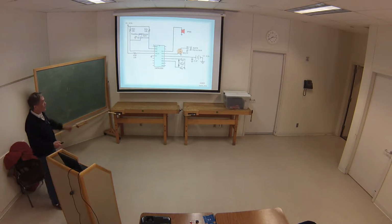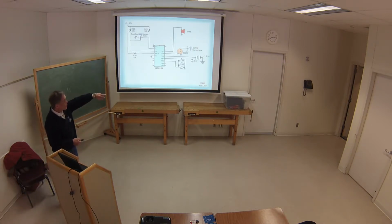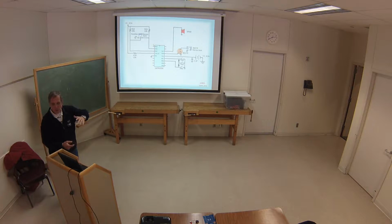So obviously I had to move things around. I wanted to still get 3 push buttons, okay? So I did 3 push buttons in this fashion, with the third one actually being the combination of the other 2 together with a couple of diodes. Push button 1 does the top one, push button 2 does the bottom one, and push button 3 will activate both of them simultaneously by pulling through a diode. And you have to do a little software checking then to say, are both of them pushed at the same time?